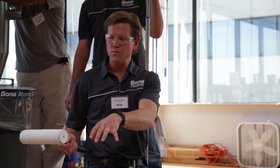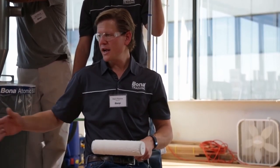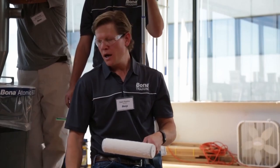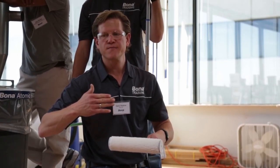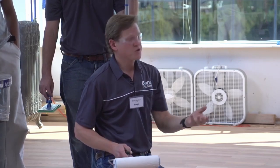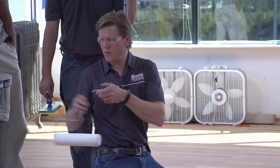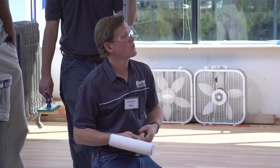In this case we had two coats of sealer going to finish, so we have a nice solid smooth build layer and we're able to work cross-grain. If we had a medallion, herringbone, or any sort of pattern, I'm not really too concerned about direction because it's not pulling and streaking like a T-bar would — it's just laying that finish out. I'll be extra careful as I feather to make sure at that transition edge, if I can go back with the grain I will, or just be lighter on that edge, holding that pole underneath.